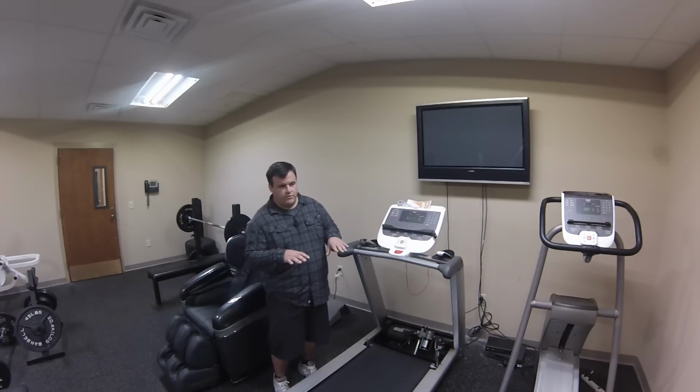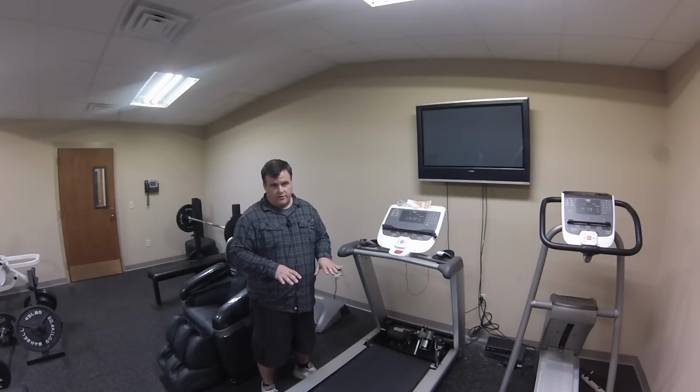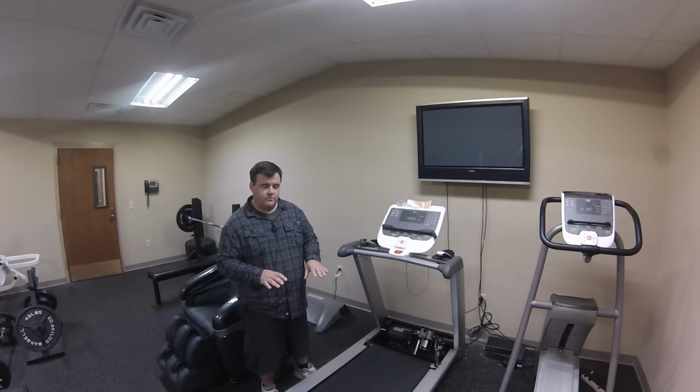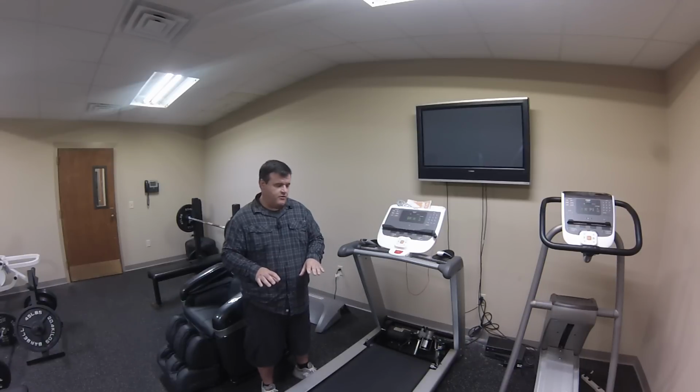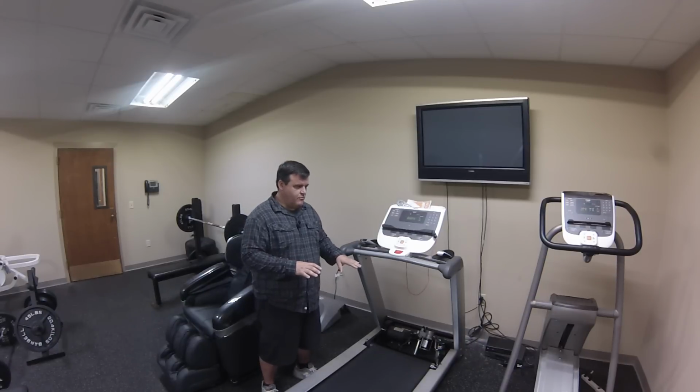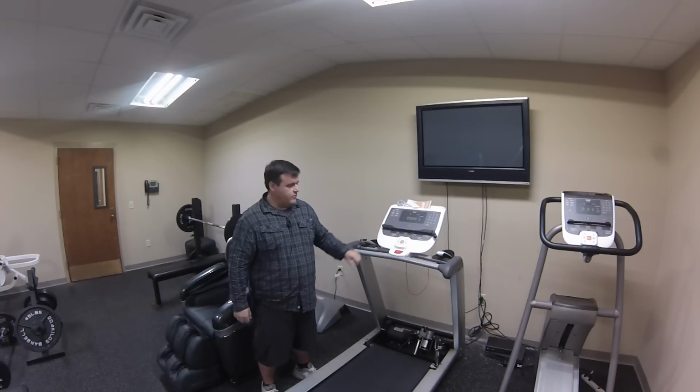So you can fix a lot of these issues initially with an adjustment, but all you're doing is really harming the control electronics, because although you're fixing the mechanical issue, which is the belt slipping, you're also at the same time creating more undue strain on the motor and electronics. So please be extremely careful in interpreting what exactly is going on.